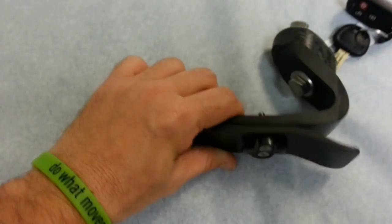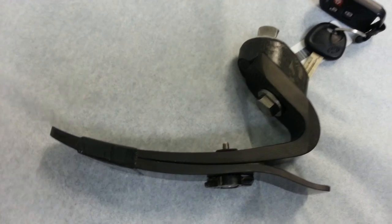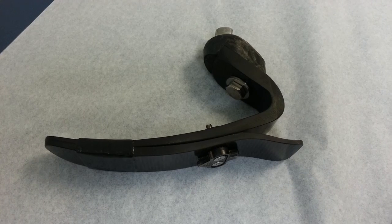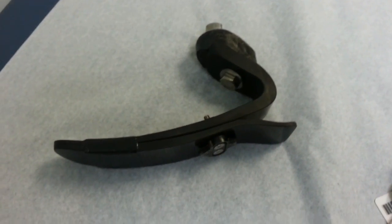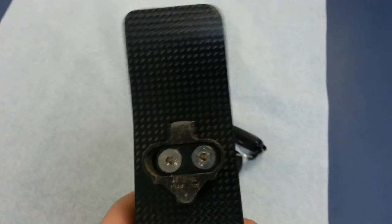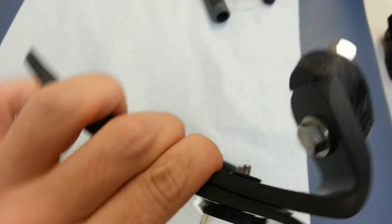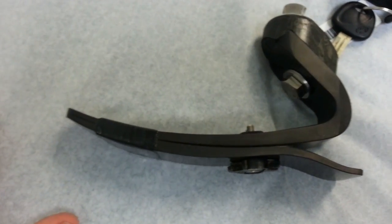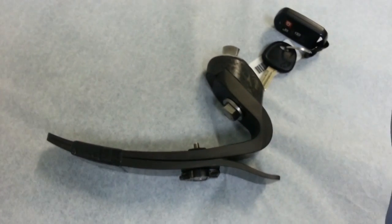What you see here is a modified version of the Freedom Innovations Senator Model Prosthetic Foot. Because we purchased this foot specifically for this application, there's no need for a foot shell. You'll note that we have attached a standard SPD style pedal cleat to the bottom of the carbon fiber foot. The location of the cleat coincides with the modified pedal stroke of an amputee. The work we've done here has no doubt voided the warranty.